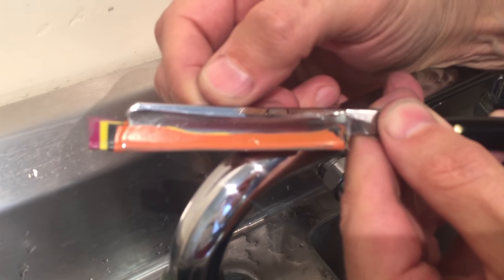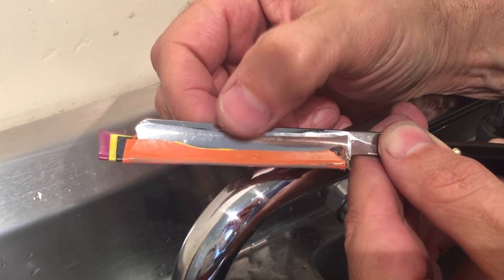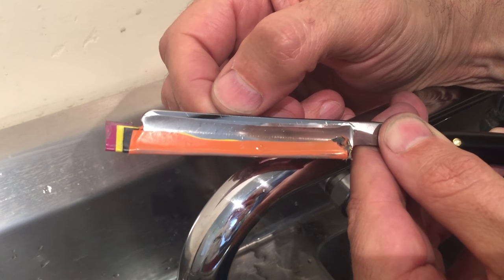Let me show you what it looks like. You're going to see there's one bevel and then there's another — almost like a primary and a secondary bevel. There's the heavier bevel on top and the real thin one on the bottom, and that's the one that's going to be resting on the stone. So that's it — I just back beveled the razor. A couple of good things I like about it: it's easy to do, it's a decent alternative to re-grinding, and it does not alter the geometry — the bevel angle is still going to be exactly the same. Even if you just put tape on wide wear bars, you're still going to have a lot of metal in contact with the stone, so the edge could still be a little wonky.